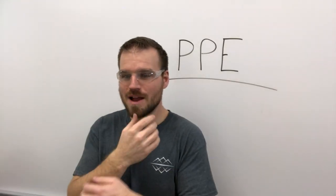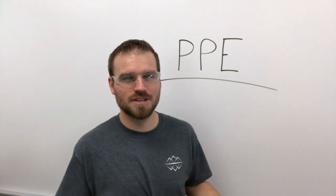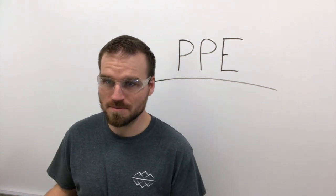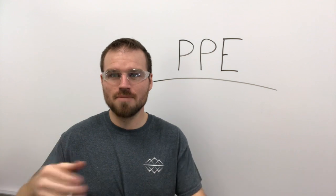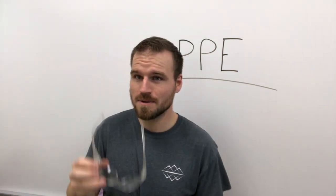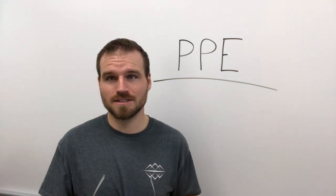All right, so I'd like to wrap this video up by just going over the PPE. We've talked about a lot of the dangers and some of the stuff we could do to stay away from those dangers, but we should also talk about the PPE required in the weld shop. Now, anywhere inside of the shop, you're required to have your safety glasses on. This is no different in the weld shop. It doesn't matter if you're wearing a face shield or welding hood, you need to have your safety glasses on.